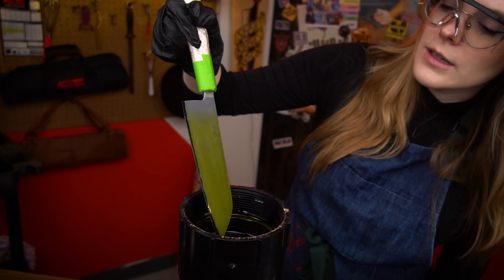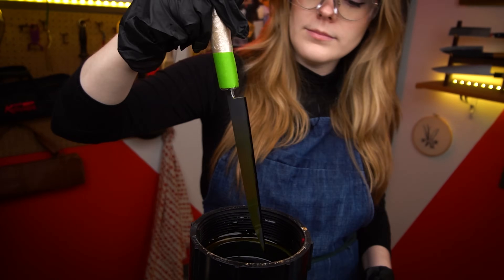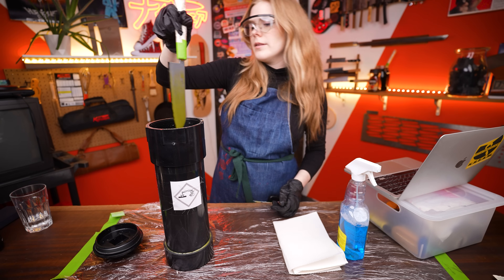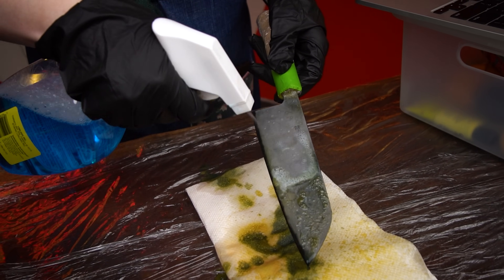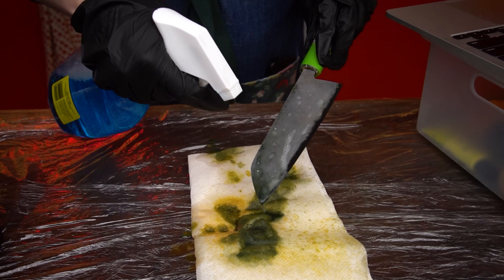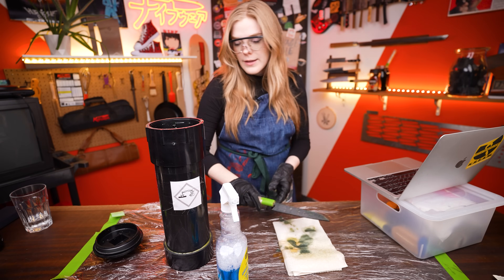A little swish. My core steel is looking really, really dark. Let's see if I can get just a little bit further in. I think I like about where that's looking. The Windex neutralizes the acid and essentially turns it into water. From here I'm just going to wash it off with regular soap and water and then my work here is done.